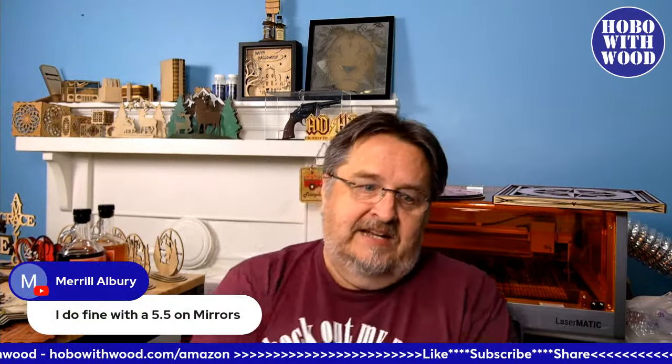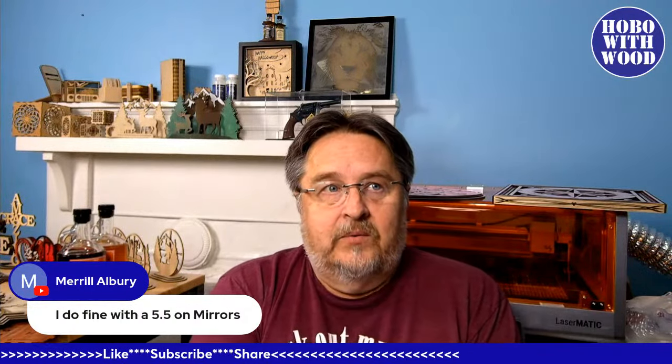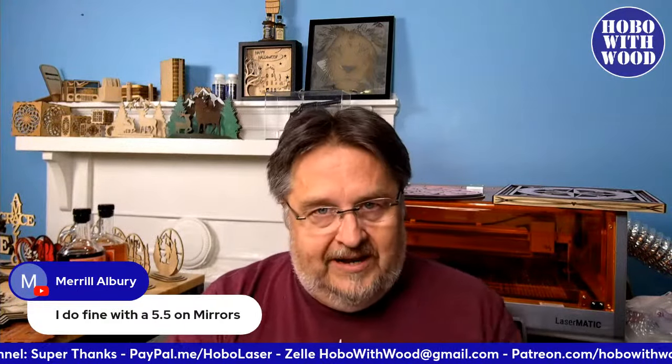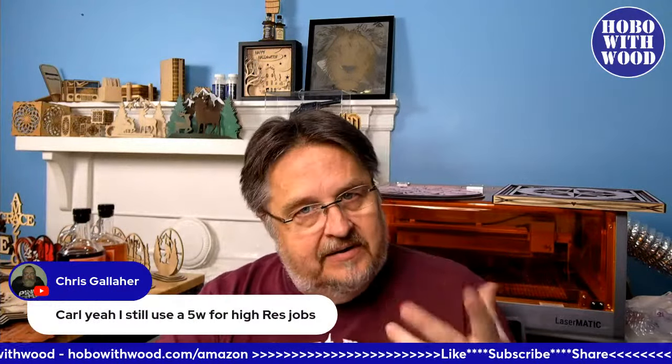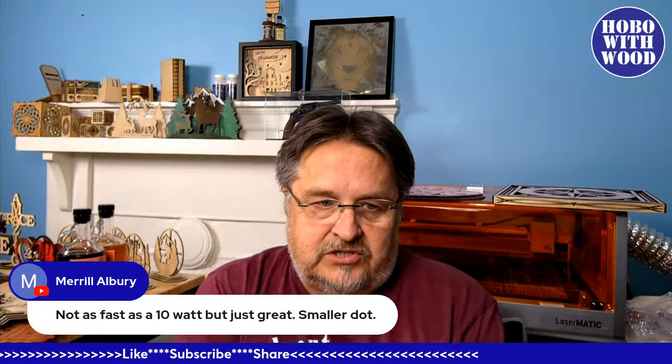Yeah, Carl says he does fine with 5.5 watts on mirrors. And I do think that when you're doing mirrors, it's not about more power and faster. If you're really wanting to do detail, with the 10 watt and the 5.5 watt, when you're doing really fine detailed work, the lower the power, the better. It's slower, but you get more detail. And that's what Chris says. For high resolution jobs, he uses this 5 watt. Not as fast as a 10 watt, but just great.